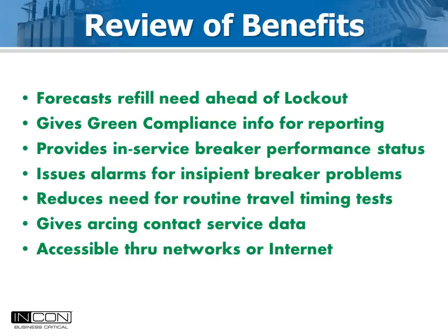The Optimizer 2 offers many benefits. It will totalize the lifetime use of SF6, making EPA reporting compliance easy. It will obviate the need for offline circuit breaker testing. First trip information will show any degradation in performance over the years. And it migrates the SF6 system integrity function toward the active and predictive smart grid realm.